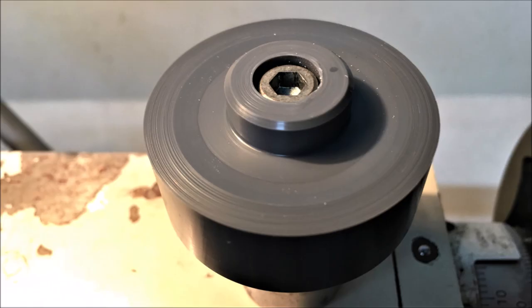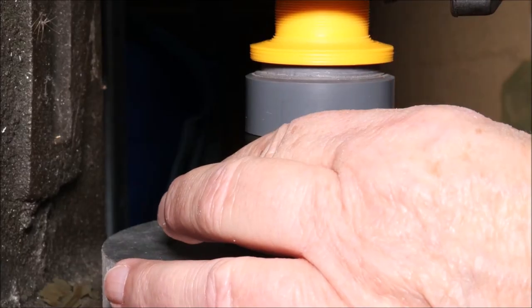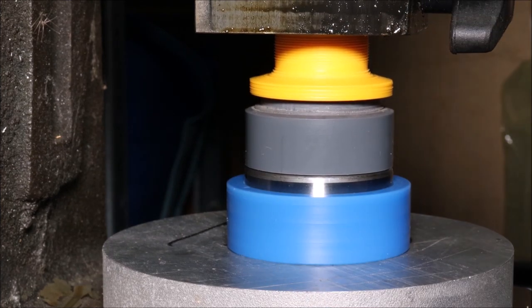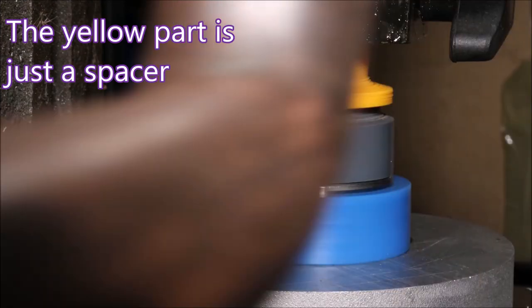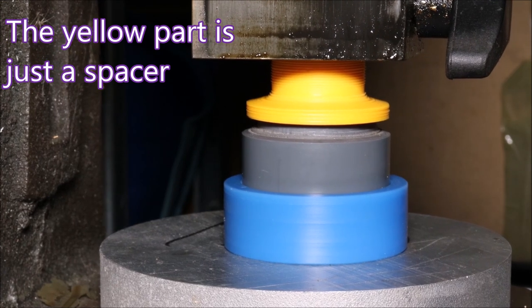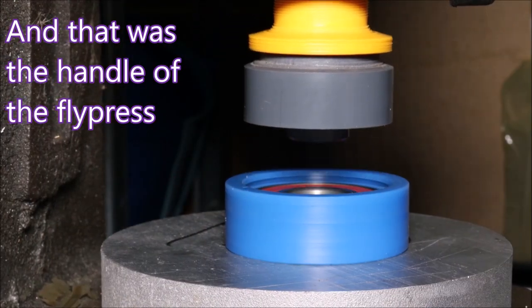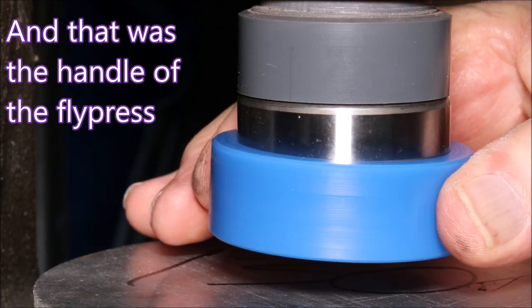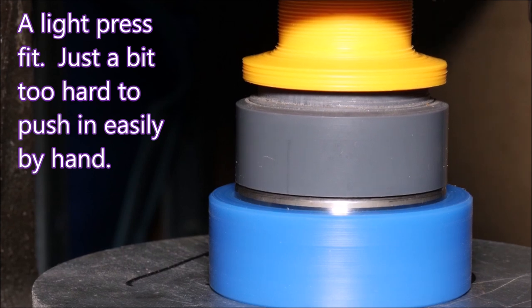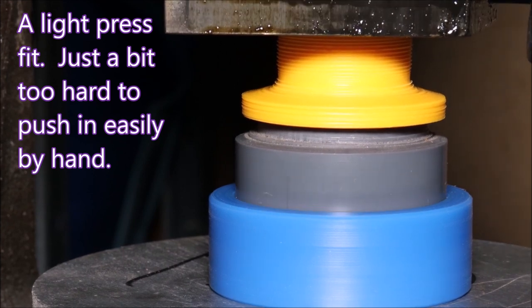Here's the finished roller ready for its bearing and circlip to be installed. I turned this up out of a lump of PVC I had hanging around the place, and this is so that I can use it to press the bearings in. And that yellow spacer — should it look familiar to anybody, it's in a previous video, that's a scrap one. Yes, that's the handle of the fly press going by. And that PVC adapter I made for pressing them in worked quite well.